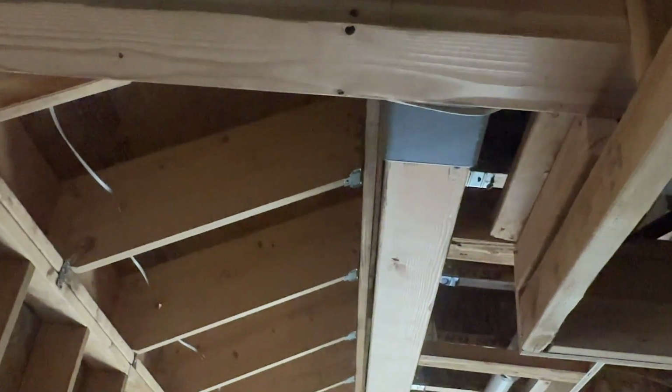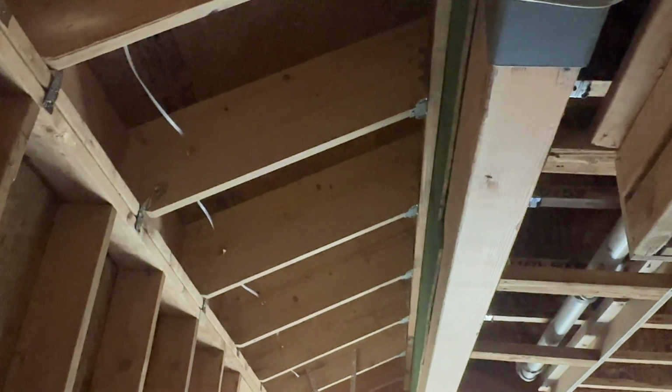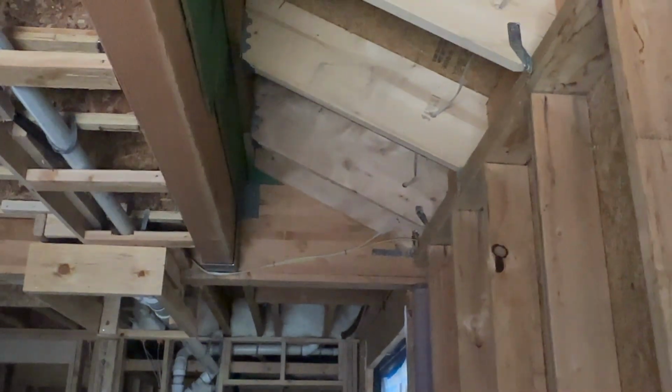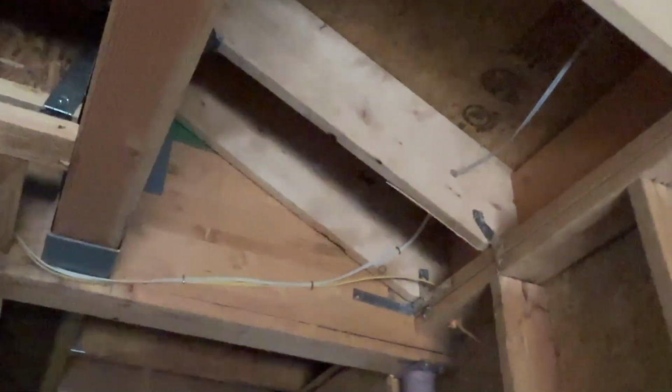And a video that I did earlier, this glulam goes outside. The way that this is built, and you can see this big glulam here as well, and this was due to Denver code with a 25% reduction on the upper level massing that was required for the old ADU code. That's since changed. But yeah, so basically this reduction caused us to create all this structure in here. That glulam went outside, and I knew I had to think about it when we did it because it was exposed. We had to figure out how to flash it.